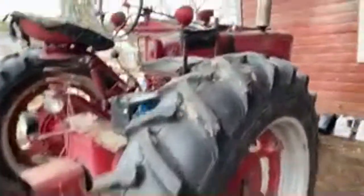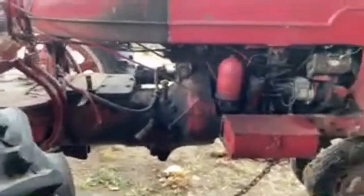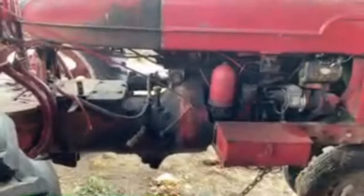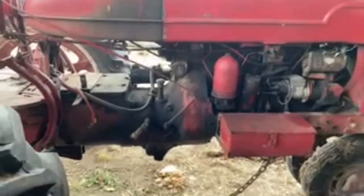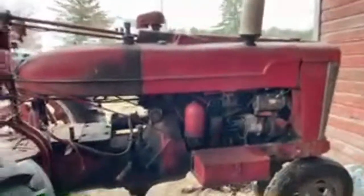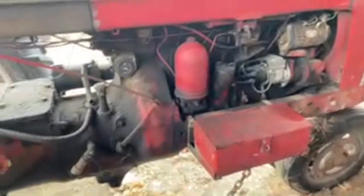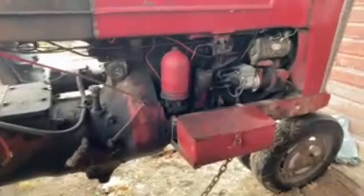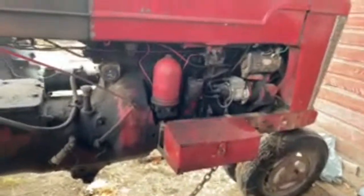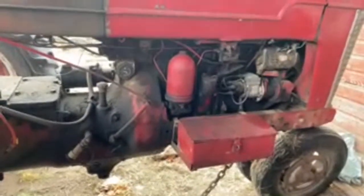But yeah, this guy's still got to get in the shed yet, or somewhere. If we get the Super M fixed this winter, or hopefully before winter, I'll probably try and put the M diesel here in the machine shed where the Super M is. The nice thing is I'll be able to start this guy and back him in, but he's got that rear main seal leak, of course. So we'll have to go through and split it, which I'm not looking forward to, but it's got to be done, because I'd like to have him back for this winter.